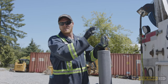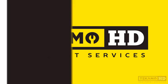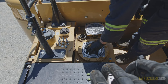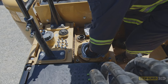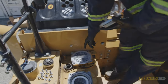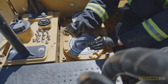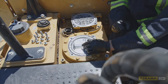That's our handle. This handle will fit on the aftermarket filter and just slide right on. Then we take the new hydraulic return filter and slide it into its canister. It's going to go onto a little pipe on the bottom too. You twist it a little bit and it drops down — it can press down a little bit more, sometimes you've got to wiggle it. You want to make sure it's all the way down. Once you're sure it's down, we take the handle we just removed. In the top of the lid, this is where the handle slots in so it can't turn or twist. You want to make sure you're lined up with the bolt holes. Give a little tap and she's on.